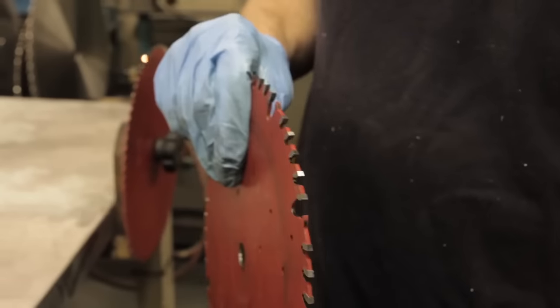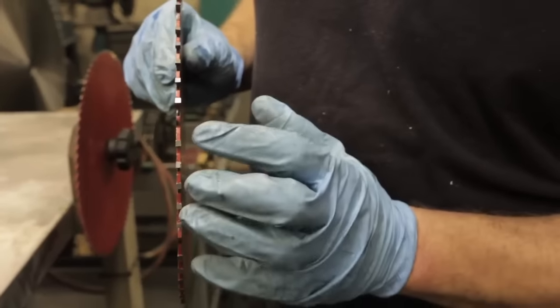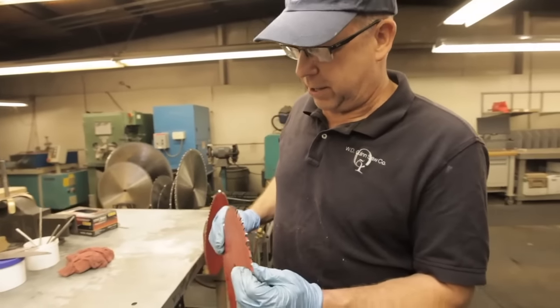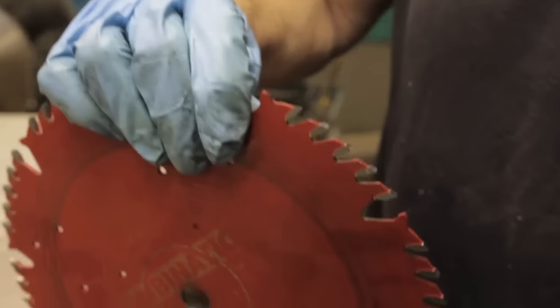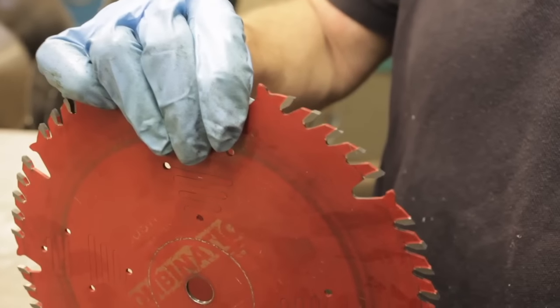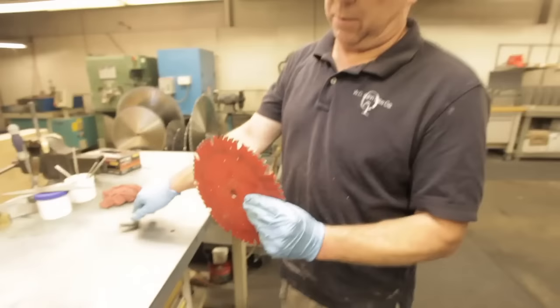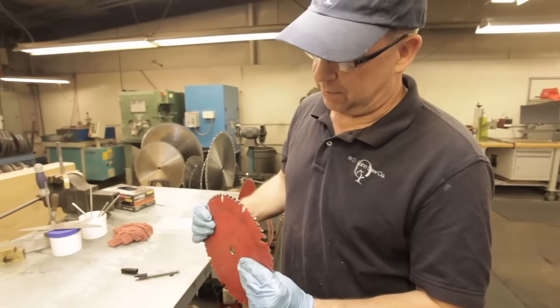So there's no need to do any of that kind of repair. At first glance, I would think there's lots of life left in this blade. We can do just a little heavier grind than we normally would. You can see on this tip here — it's not only affected the top, but it's done about a 30 or 40 degree angle off to the side. So I would probably mark that one as a tip that would need to be replaced.